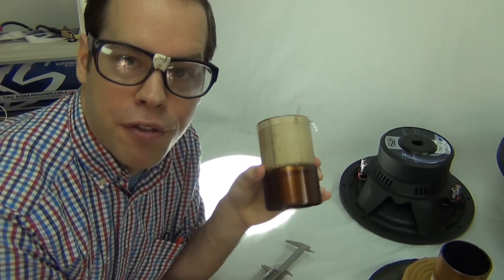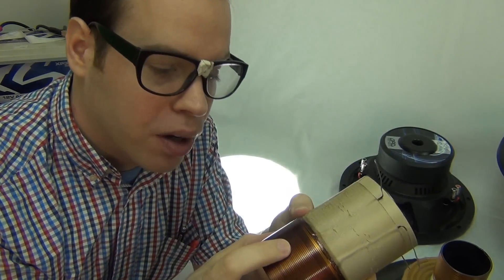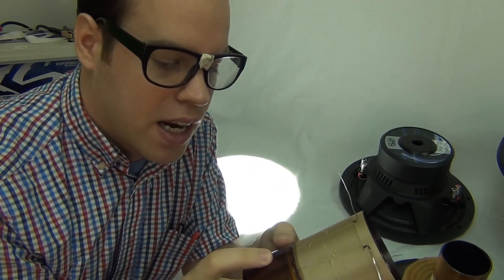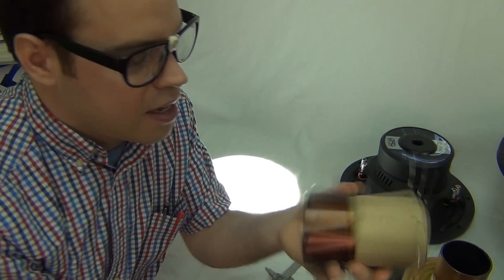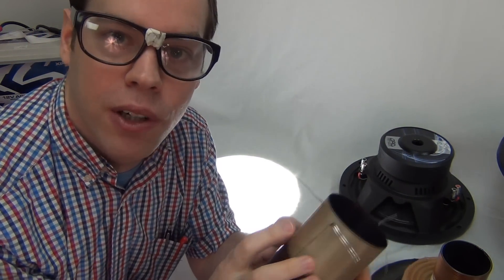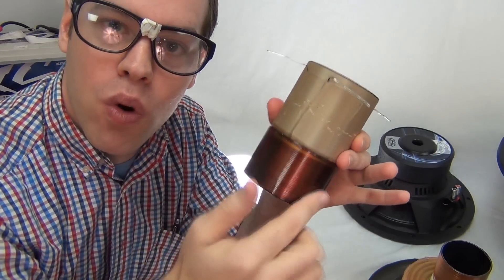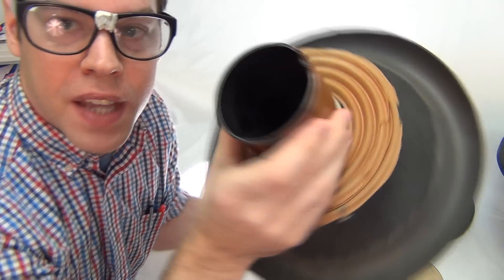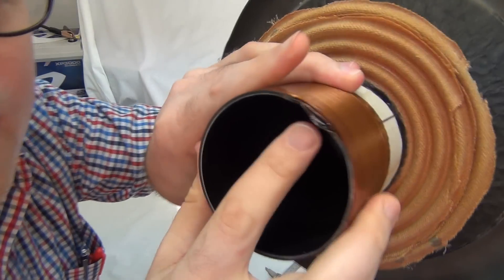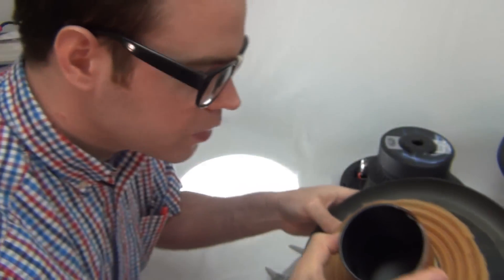The diameter is just over three inches, so this is a three inch voice coil. The wire itself is made out of aluminum cladded in copper, which keeps weight down and makes conductivity a little bit higher than regular aluminum. The former, or bobbin, is made out of aluminum with a paper fabric material over it. A dual voice coil means there are two coils wrapped together, and each coil is two layers, making four total layers. I peeled back the former on another coil and you can count one, two, three, four layers.